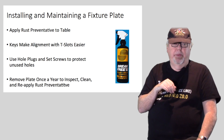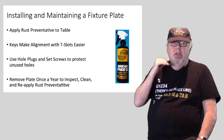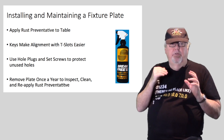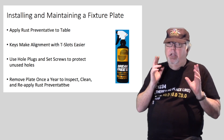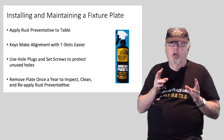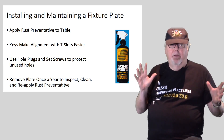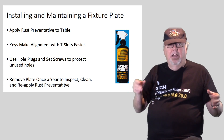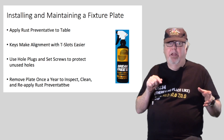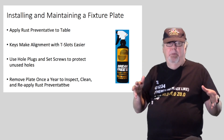You've just gotten in a fixture plate and you're ready to install it. Before you put your plate on the machine, apply rust preventative to the fixture plate and the machine table — you're going to be leaving it on the machine for quite a while and you don't want rust getting started under there unnoticed. It's nice if your plate has keys to align it with the T-slots during installation. And if the rust preventative contains a little oil, it makes sliding the plate around on the table to align it that much easier.